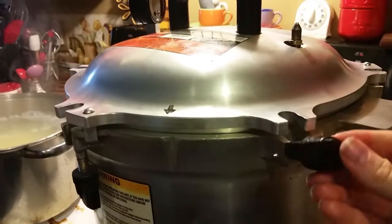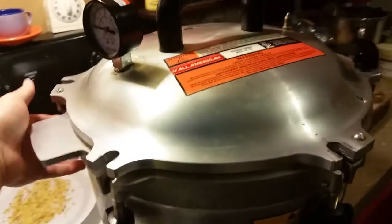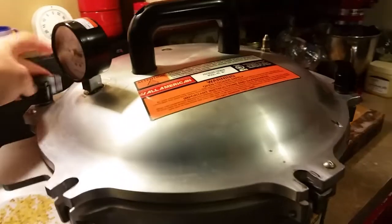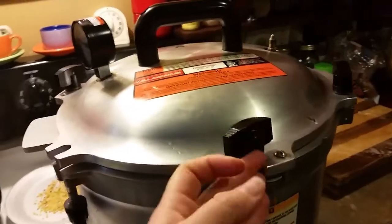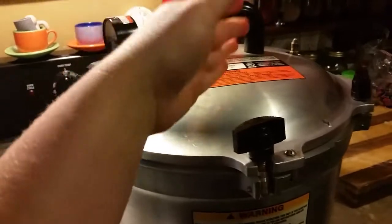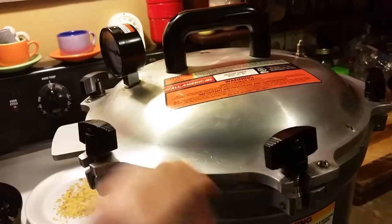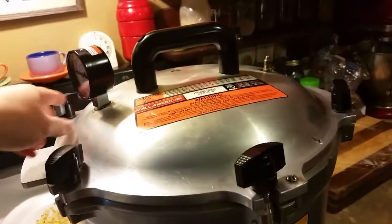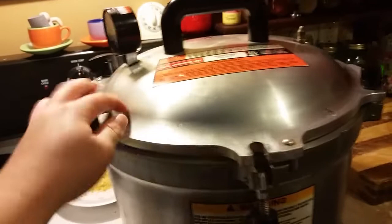And then you take the opposite wing nut, and I'm doing this one-handed, so think of me doing it with both hands. But you do opposite wing nuts like that, and you'll take it down, but not tight yet. So you do those, and then you do this one, and it's opposite, this one, and it's opposite. Then, after they're all semi-tight, you make sure everything is equal, and then you tighten them down again, opposites, opposites, opposites. And that's just, again, to make sure that the lid is on there correctly.